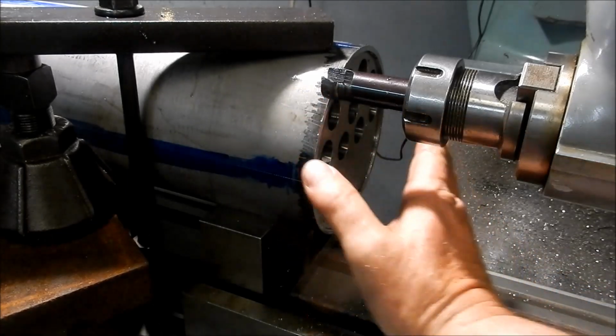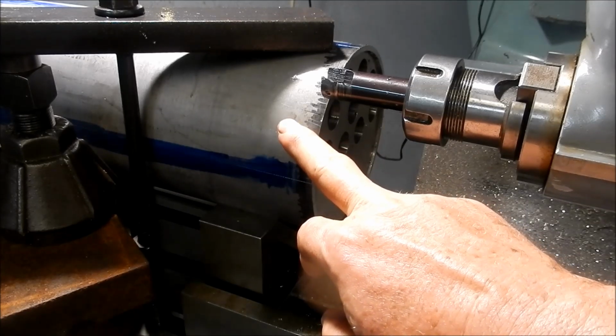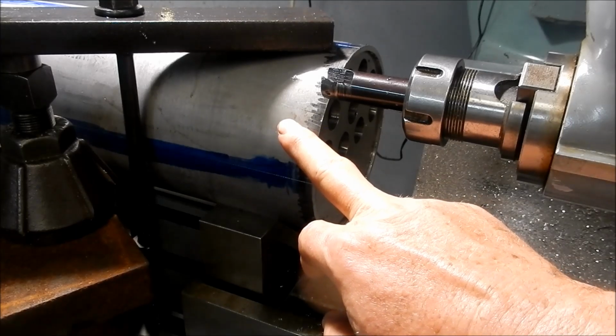We've got a nice flat face now. That's at 90 degrees to the center line of the barrel. I'll flip it around and give it a lick on the other side, and it just gets everything nicely squared up so that he's got some reference points to work from. All right, guys, we'll see you soon.